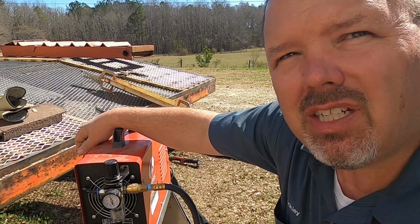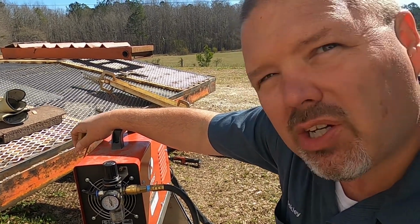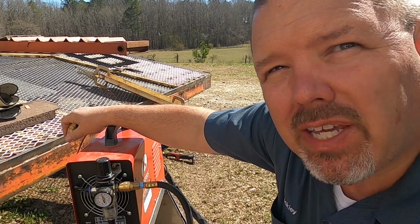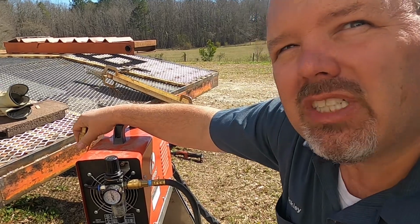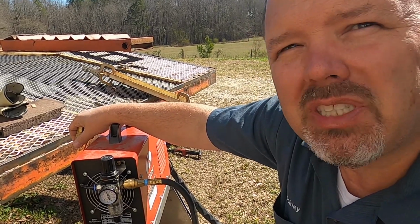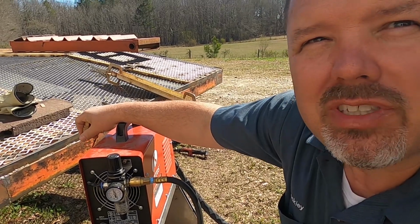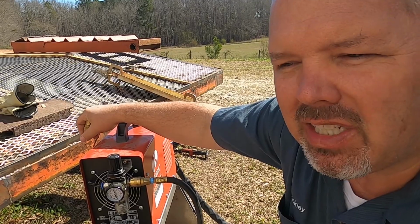In fact, I'm fixing to cut some 1/2-inch metal, and I'm thinking about doing a little video while I cut it and to show. Now, I know you're supposed to use that guard or keep it a certain distance off of it, but what I have found with 1/2-inch stuff is to get on down next to it, ride it on it sometimes. It does fine. You burn up a tip, but for the time you save cutting 1/2-inch thick steel, it's worth a tip, you know. Or I buy them in bulk.